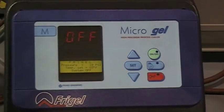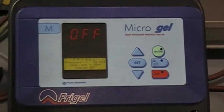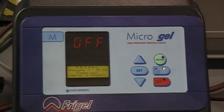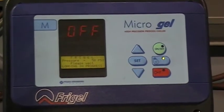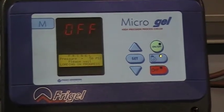Make sure all your water lines are open and drain lines are open, and begin to start up by starting the pump. This will fill the fluids throughout all the circuits and equalize the pressure in the system, and then it'll be ready to start up.